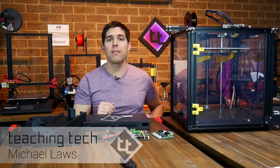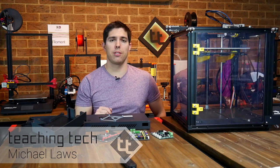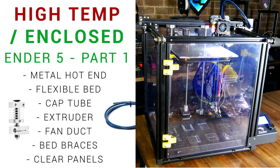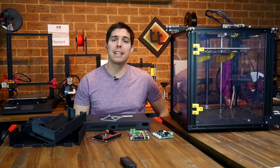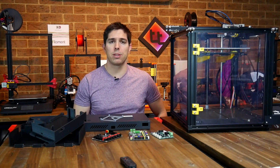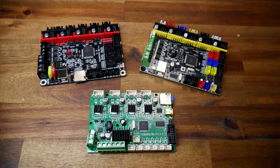This Ender 5 is currently undergoing quite a transformation. The end goal is to have a specialist printer capable of doing ABS, nylon, and polycarbonate. Previously, I performed a range of mods including this acrylic enclosure. And in the future, I'll be adding a lid as well as giving it a heated build chamber. But to do that, we need to upgrade to a mainboard with more outputs. So in this video, I'm going to provide a guide to fitting the SKR version 1.3 as well as the MKS Gen L.